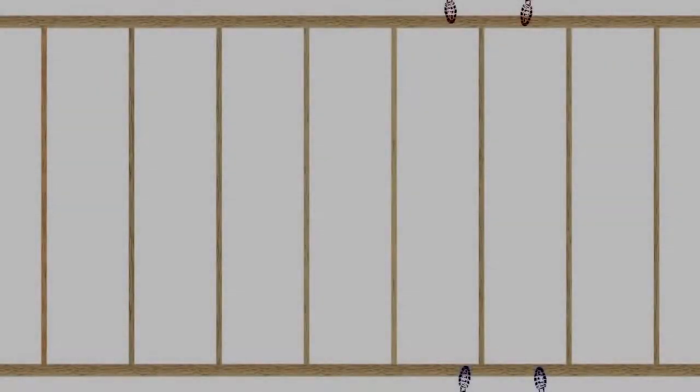Sawyer 1, operating on the purlin on the fire side, reaches out approximately four feet and cuts back to the purlin they are standing on. Sawyer 2 will do a mirror image of what Sawyer 1 is doing for the duration of the cut sequence. Sawyer 1 and 2 cut a triangle utilizing their head cut, big enough to fit the spikes of a trash hook through.